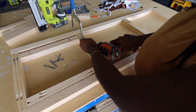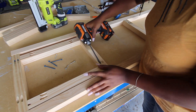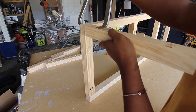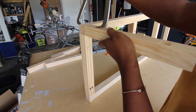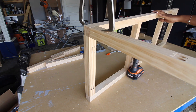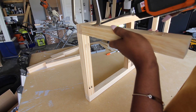It's a pretty simple base for this leather bench. I'm basically just making two sides that are identical to each other and then I'll be attaching them together. Now that I've got both sides assembled, I'm taking four two by twos and attaching them the same way using the pocket hole screws, and again using my right angle clamp to hold it in place to make it easier to put together.